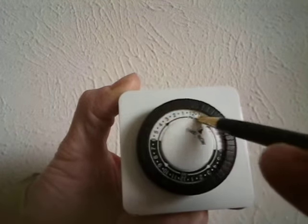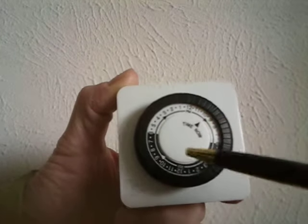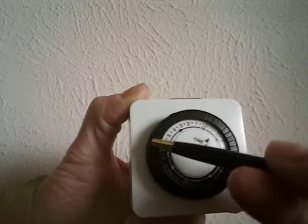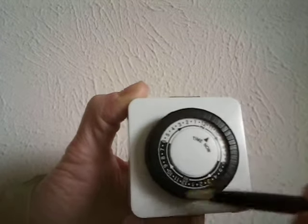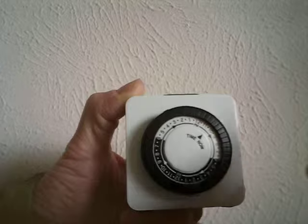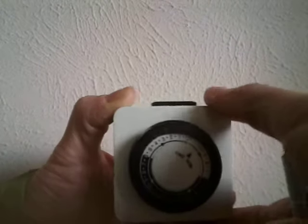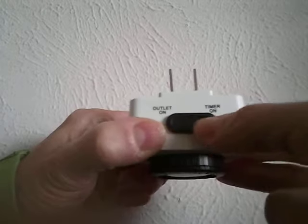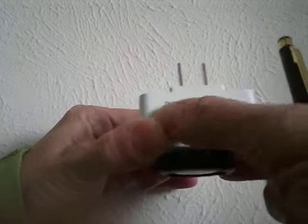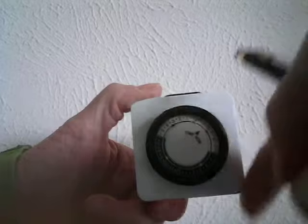Also, the arrow buttons threw me off. It's only for the purpose of dialing it clockwise, because it only dials clockwise. But you have to set the time counterclockwise by pushing the buttons down in the counterclockwise direction to get your time correct. To start off, make sure that your selection switch for outlet on and timer on is on the top, not the sides or bottom. Keep it on the top — that simplifies things.